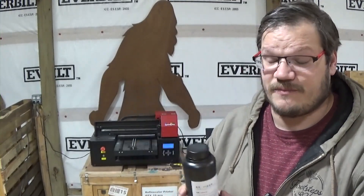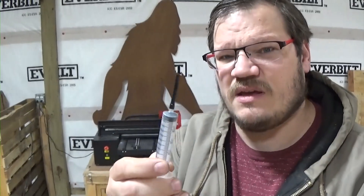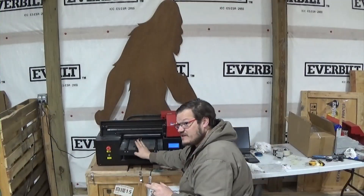The white channel has been sitting for about three weeks and it appears the head is a little clogged. To fix this, I'm going to use some UV cleaner. If you don't have UV liquid cleaner, you can use denatured alcohol or rubbing alcohol — it will eat away the UV ink, so don't do this too much, just when you need it. You're going to need your syringe — just a normal syringe with a little piece of ink tubing pushed in on the end. Load the syringe up by opening the ink bottle and drawing in some fluid. Then shut the printer off.